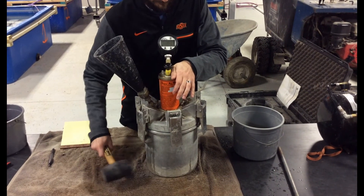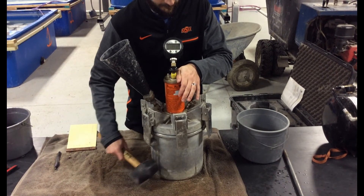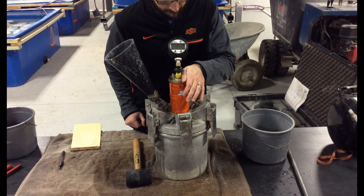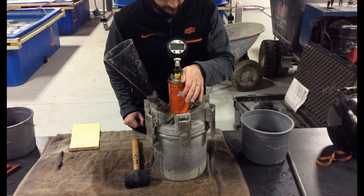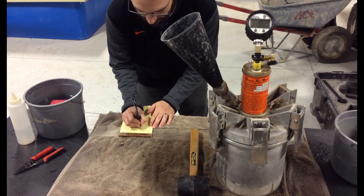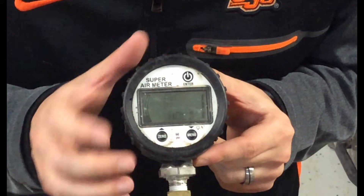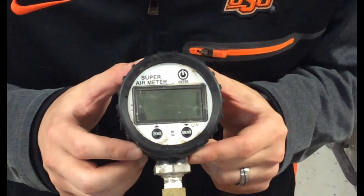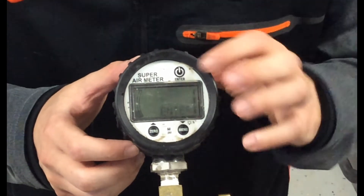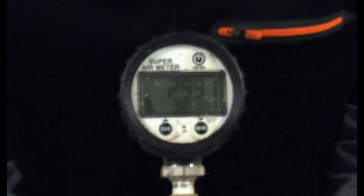During the 10-second countdown, keep holding the lever down and strike around the SAM bowl smartly. Keep striking until the countdown ends. Keep holding the lever down until the gauge reads okay. Record the equilibrium pressure from the gauge. Press enter on the gauge to view the air content. Record the air content when it is viewed, then press enter to continue. The gauge allows you to be within plus or minus 0.05 psi from the current pressure step. The gauge will flash either low or high — take the necessary corrective action.